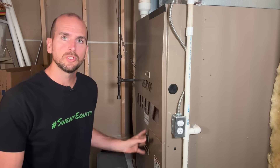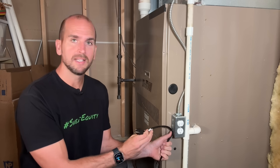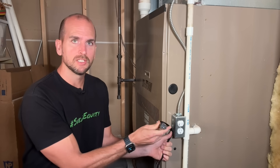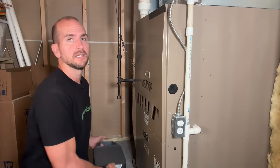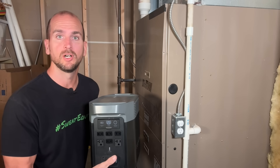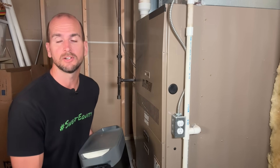For a gas furnace we really only need to power the blower fan and the circuit board in a power outage. You can wire in a simple cord and bring it out of the handy box — it powers the furnace and normally plugs into this outlet. In an outage, unplug it and plug that cord into something like an EcoFlow Delta portable power station, which can keep your furnace running for eight hours or more, preventing freezing pipes or uncomfortable temperatures in winter.